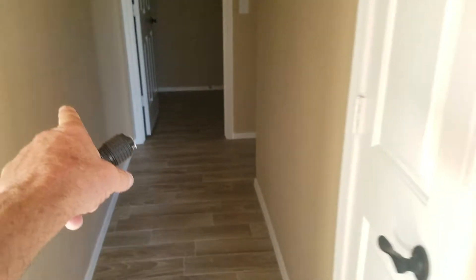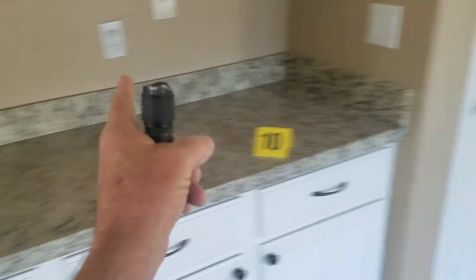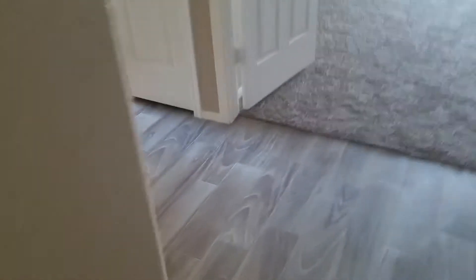Usually there is a keyway joint running through here. But coming through the garage, there is a crack that does come through the house on that side. So over time, the south side of this house could move if the rainwater is not stopped. Dirt grading needs to be done to slow it down and stop it — otherwise it could continue to move and crack the tile in this area.